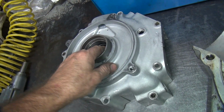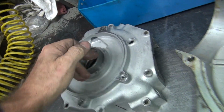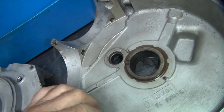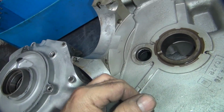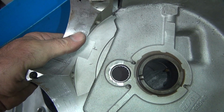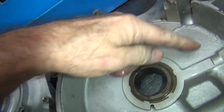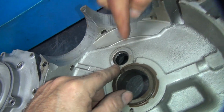If this Timken bearing wasn't tight, or the sprocket here, the shaft could go down deeper, the crank, down until it started hitting in here. That might be what happened. Or they got an extra long crank pin in there, or something. Because that's been rubbed in there, it's not ground. Something going in a circle like that made that. Yeah, scored all the way around.